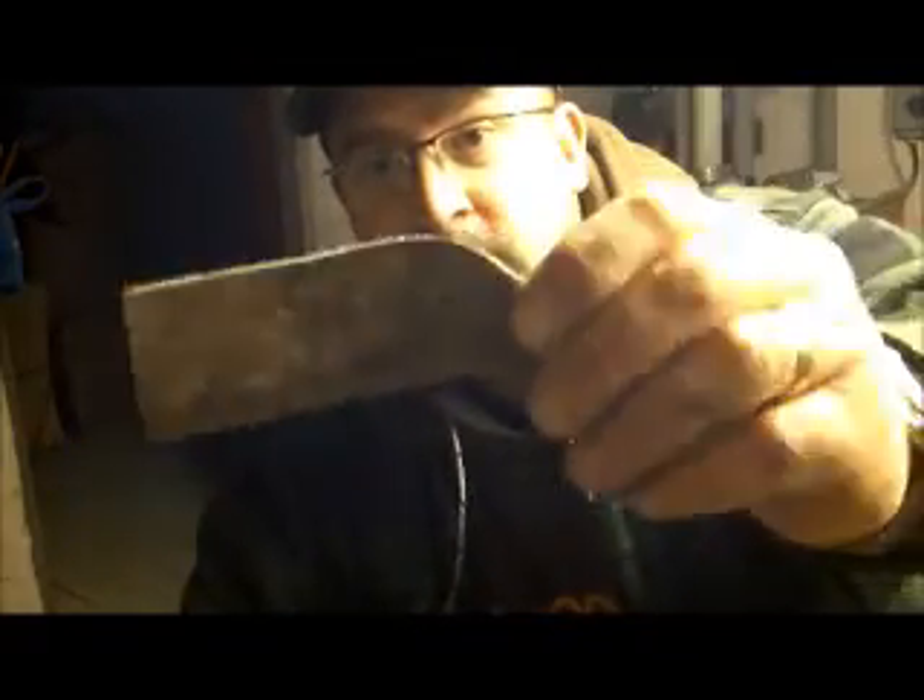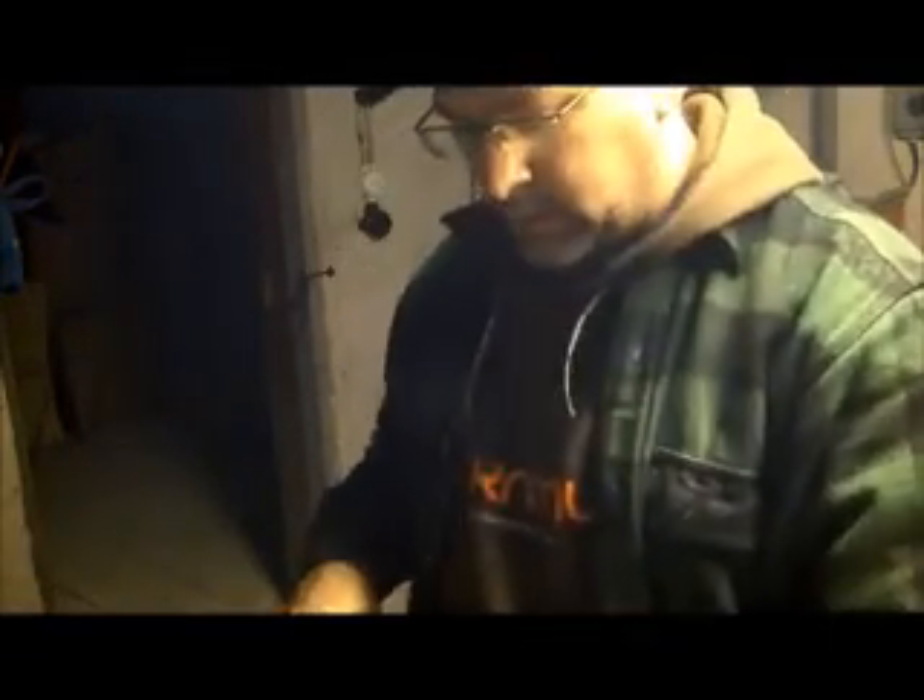At the moment I've picked out the piece I want to use for the base of my sheath, which is this piece here. I'll cut it in half and I've marked off where I need to carve out for the blade to sit in — like that. Obviously that needs to be filed down slightly just so the blade, when it pushes into the sheath, will slide into the section at the beginning. I'll get both sides done and the blade fitted in and we'll see how well it fits.